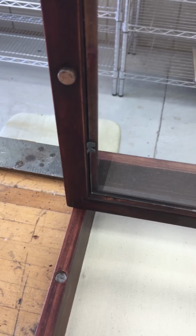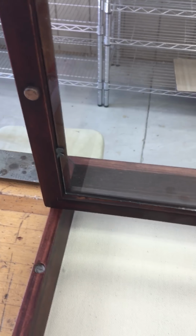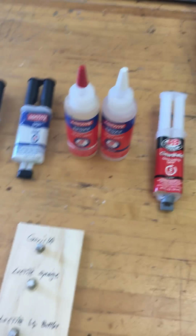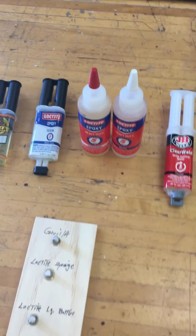So anyway, the issue is these magnets are so powerful that the glues, the epoxies we use, have a hard time holding them in the box because we're using N52 face to face, which is pretty strong. It has a heck of a pulling capacity. We've used many adhesives over the few years, and these things still have a tendency every now and then to pull out of the box, particularly the frame, because they're sticking up a little bit.